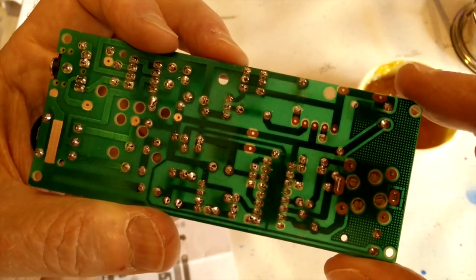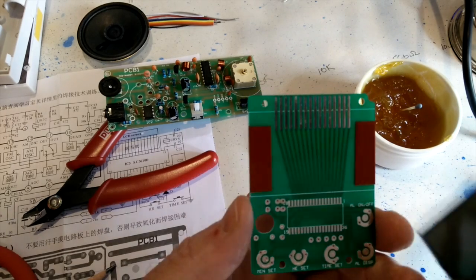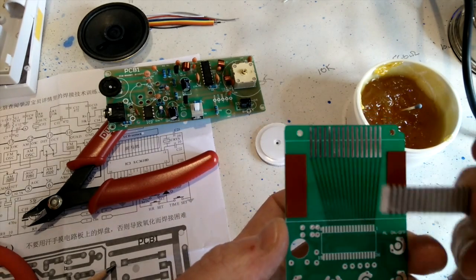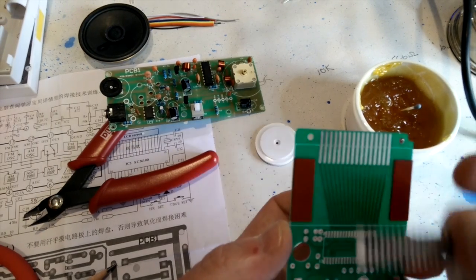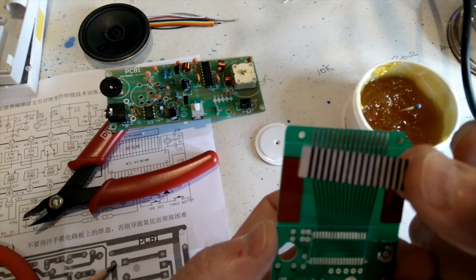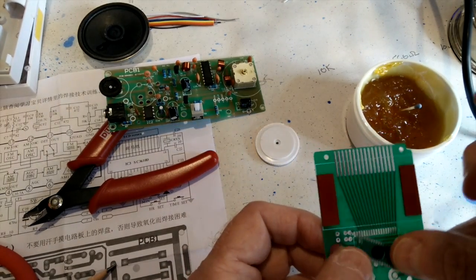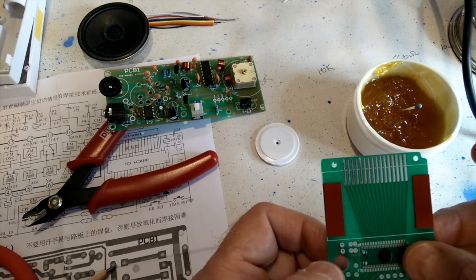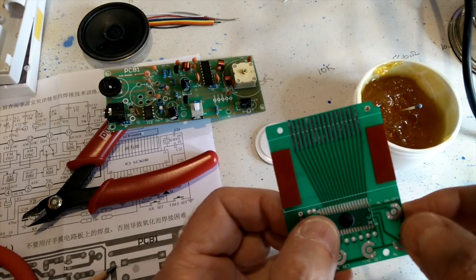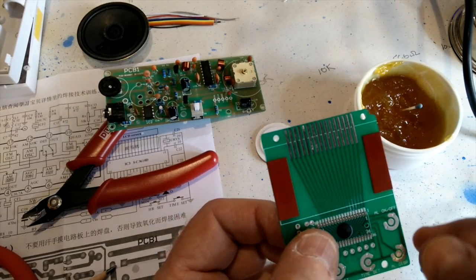I think this part of the board is almost done. Here's the secondary circuit board that has to be soldered together. The LCD fits on top and uses little ribbon cables to attach the display to the circuit board. They gave me about eight ribbon cables, so I guess they figure you're entitled to make some mistakes. There's a small chip-on-board LCD driver that has to be soldered on here, and some little button switches that have to be taped on top.